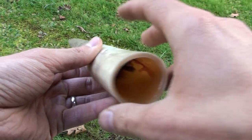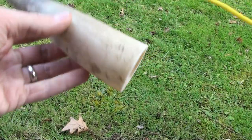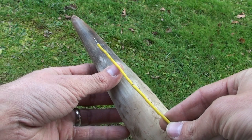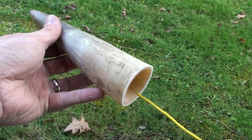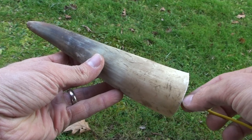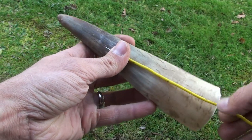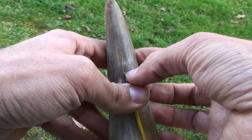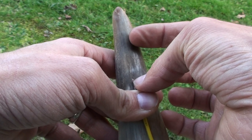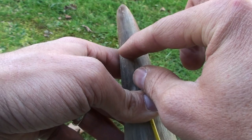As you can see it's not perfectly round, but we're not going to worry about that right now. The next thing is to cut this off down here for our spout. We're going to take a piece of wire and run it up inside to where it stops — that tells us where we need to cut from. So I come in here, put it in, stop right there, bring my thumb down, pull it out, and mark that point. Then I'm going to come down about a full inch on this horn and make my cut right there.